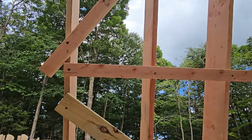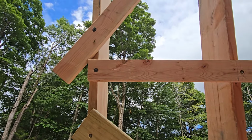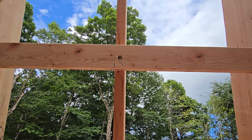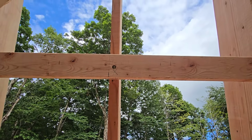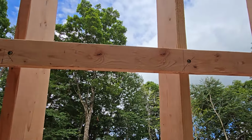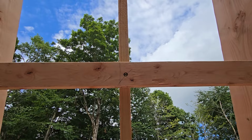But one thing that's very key, I'm going to try and climb up here if I don't trip. Okay, so I'm up here, and you can see this 2x4 is horizontal. It's screwed in, and then as you come over, these are on 24-inch centers. Because these beams are so big and we're using 5/8 plywood on a steep pitch, we can get away with going 24 on center using fewer rafters because they're so big.